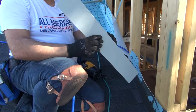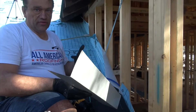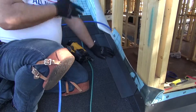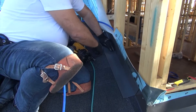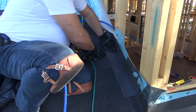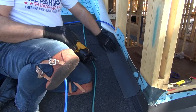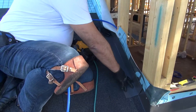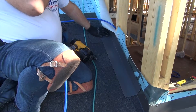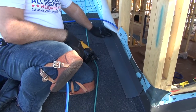Typically what's been happening in Australia in the past with shingle roofs is that they're using the Colorbond flashing system. It works for Colorbond, but when they put this down, the water gets in underneath it and it just leaks. Sometimes they'll put caulking underneath and push it down and just leave it as is — and it's just a terrible way of flashing it.